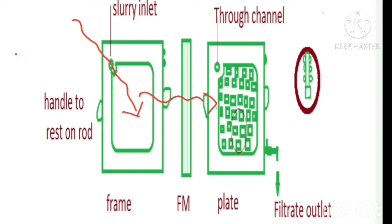The plate has a studded or grooved surface, and its surface is maintained to support the filter medium. The filtrate is drained between the projections on the surface of the plate, and the drained filtrate is collected through the outlet into a receiver. This is simply the filtration operation.